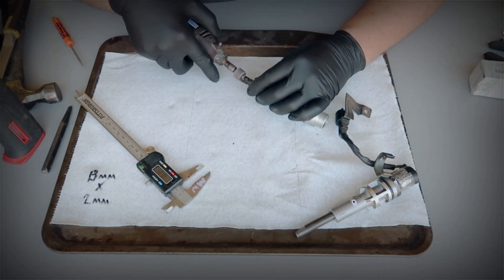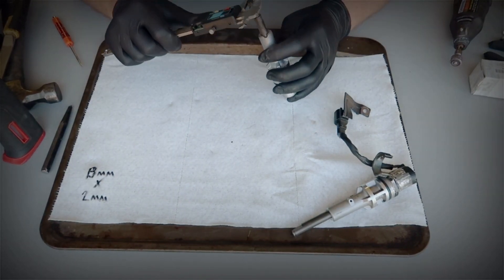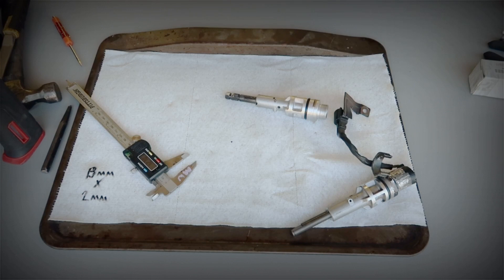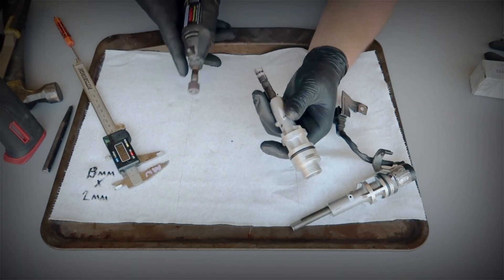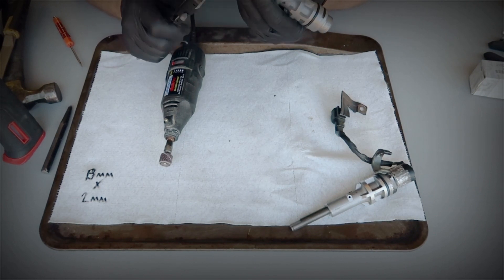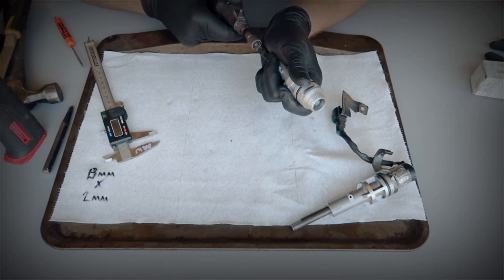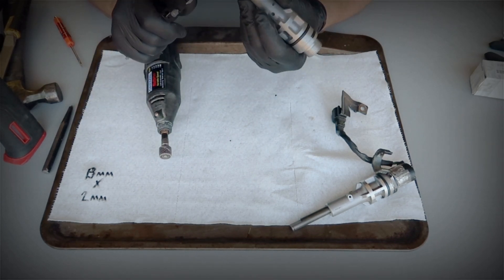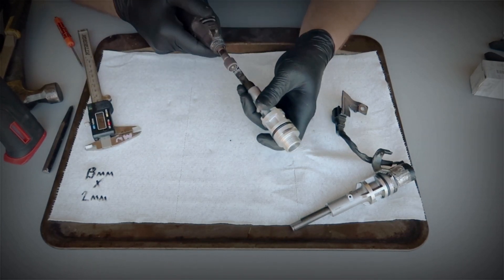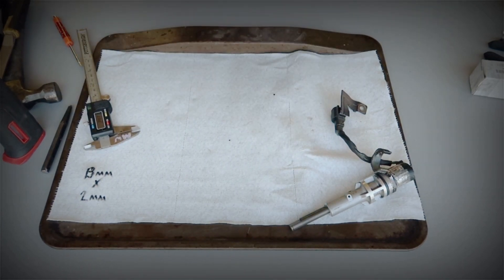If you're paranoid, go ahead and keep taking measurements as you work just to make sure you're good. You do want it to be a true 90 degrees — you don't want any taper to that surface. It's gonna defeat the purpose of having that notch there if you have any taper or if it's truly not 90 degrees.